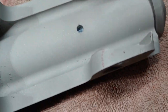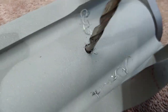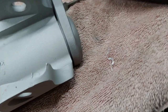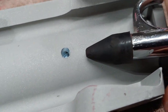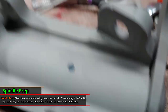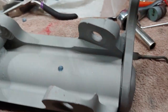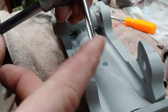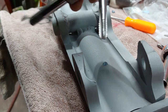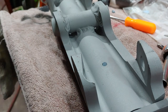The next step is to take a drill and just drill the hole out, and then the next step is to take a tap and go ahead and tap that out. I actually had to modify the end of this one — last time I did this on my spindles, I just had to kind of take the point off of it, and that helped me to get down in there better.